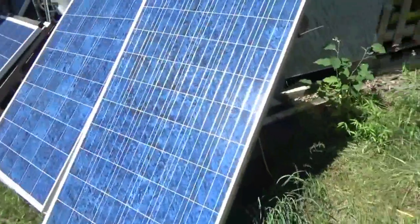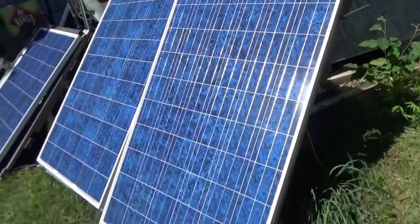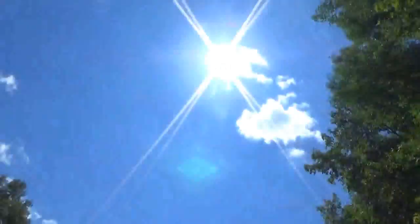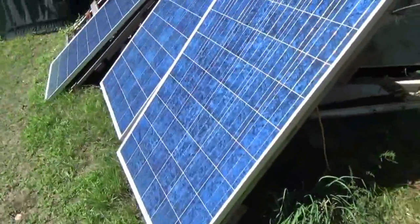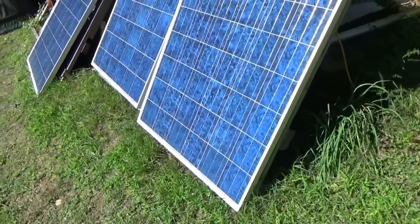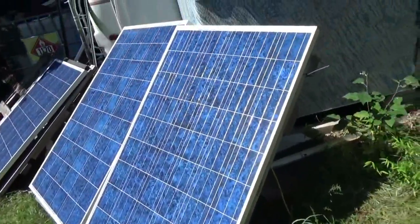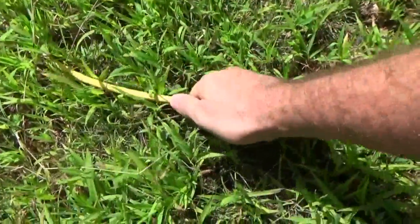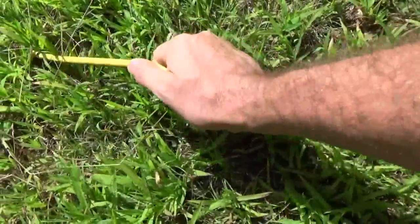Just inside, you can see the solar panels are in full sunlight right now. They are angled right at the sun, and I have full direct peak sunlight right now, and I'm only getting 200 watts out of 470 watts of solar. So as I had feared, this wire is too thin, and it is hot to the touch. This is hot.